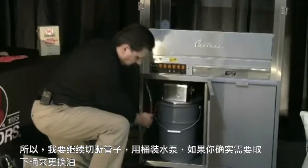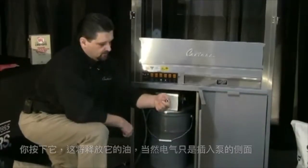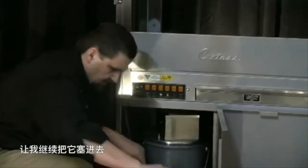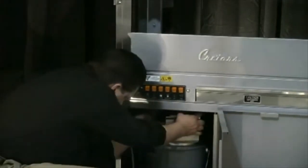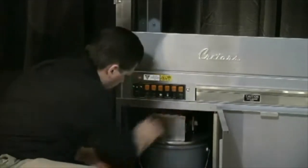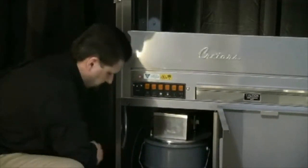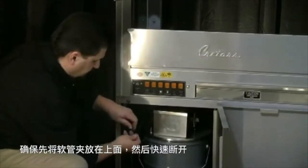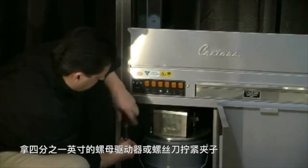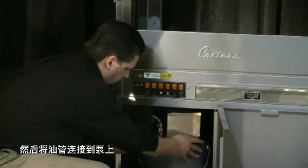You want to try to keep it as short as possible. If you do need to remove the pail to change the oil, there is a quick disconnect that you press to release the oil from it. The electrical just plugs into the side of the pump. I'm going to go ahead and cut my tube here and install my quick disconnect. Make sure you put your hose clamp on first, then your quick disconnect, then you can slide your hose clamp back down. Take a quarter-inch nut drive or a screwdriver and tighten the clamp. Then you can connect your pump oil line to the pump.